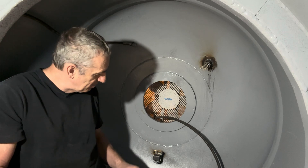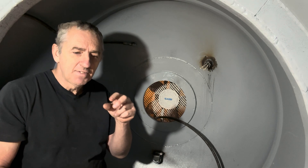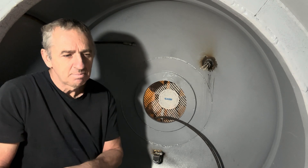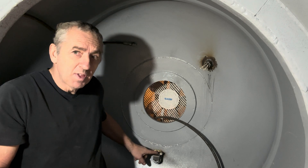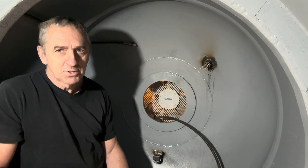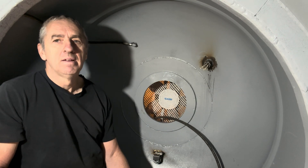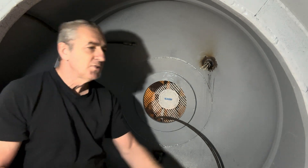What I had to build today was a stopper, because when that shaft unthreads and comes out of the weight, water pressure would pop it right inside the submarine with nothing stopping it. I don't trust circlips for this, so I made a simple stopper that bolts on. I just drilled a hole through the side of the nut so I can put a rod or Phillips screwdriver through, turn it a quarter turn at a time to unthread it, then the rod pops in and hits the stopper. Simple — got to keep it simple.